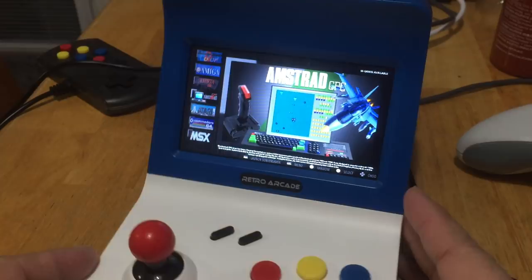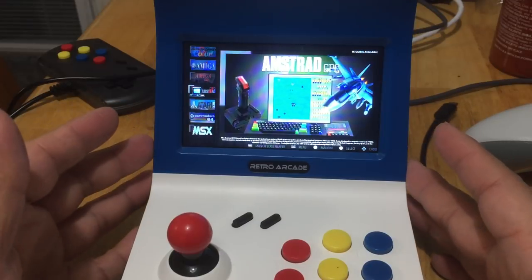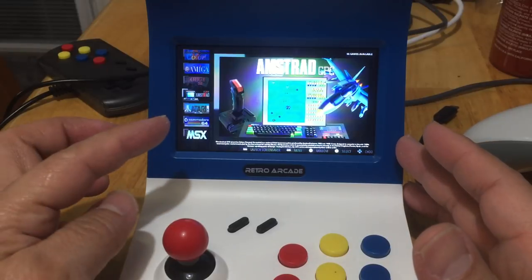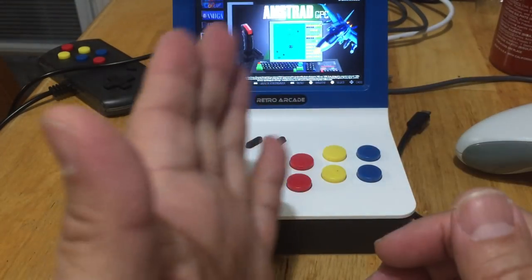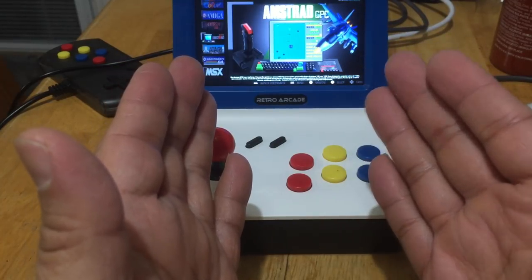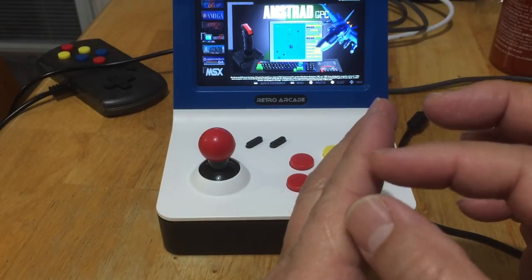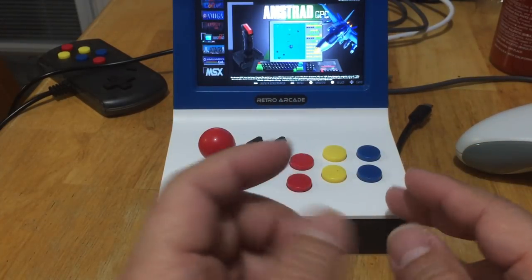All right. Another question is, can you play this on a big TV? No, not at this moment. The hardware is capable of playing on the big TV, but the problem is the Adafruit, the video card that you purchased for $13, is doing the video display for this screen. The Raspberry Pi is over here, and the Adafruit video card is sandwiched together with the Raspberry Pi, and the ribbon between it is preventing you from plugging in the HDMI connection. Plus, the configuration is set up to boot to use this smaller resolution.